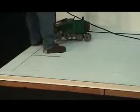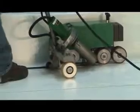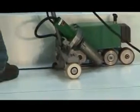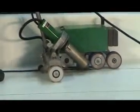When welding projects with the automatic hot air welder, always be sure to have a crayon or marker handy. At any interval that the user stops and starts the machine, it is wise to make a mark. Then have another installer follow behind the individual running the automatic hot air welder, and he or she can simply weld down all the voids that have been marked previously.